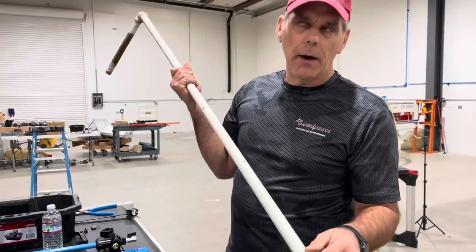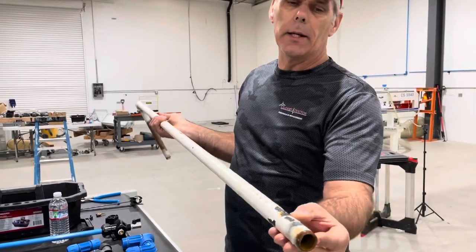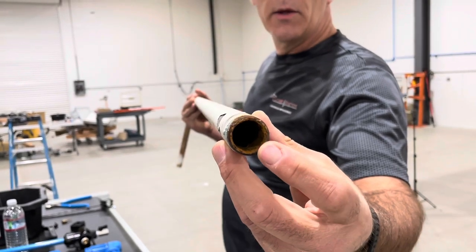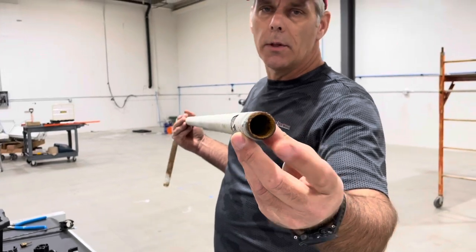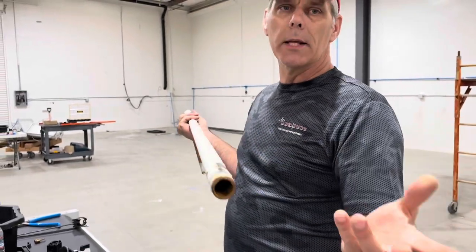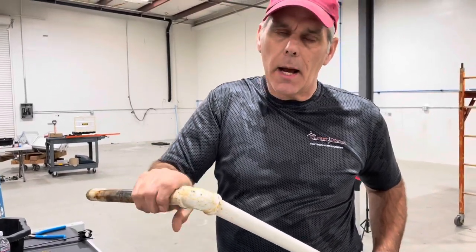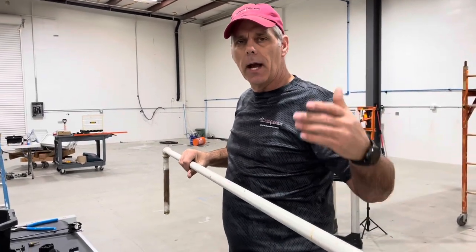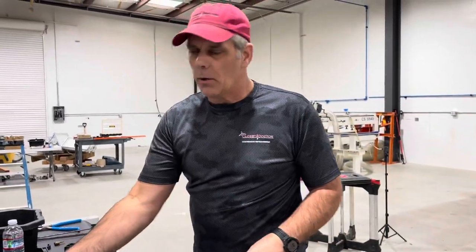Another option I've heard people talk about — and there was some of this in this shop — is just iron pipe. It goes together with threaded connections. The problem is you get moisture in your airlines, you're going to have condensation in there that causes rust and corrosion, and you don't want that stuff running through your machines. It's quite expensive, you have to twist everything together, tighten it, put pipe thread on it, and if you need a non-standard size you also have to thread the end. Not really a good solution — a lot of work and fairly pricey.